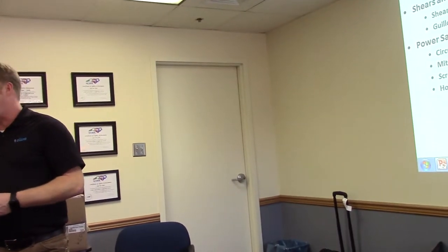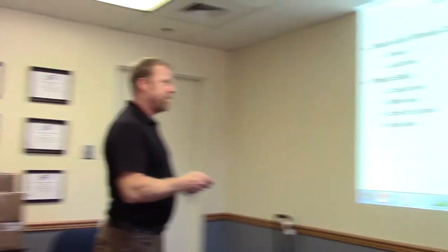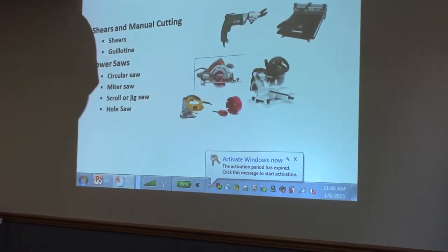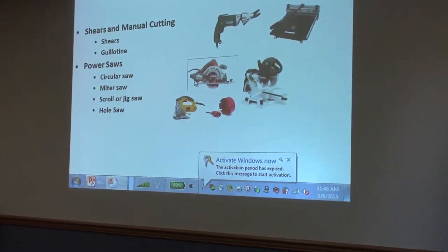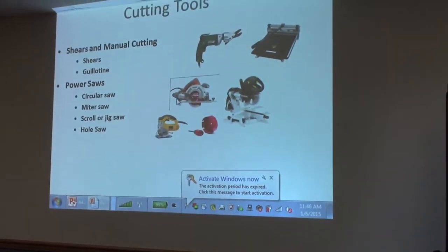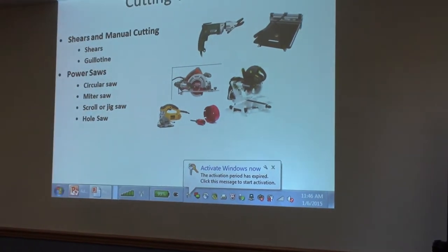If you're a professional contractor, you can't stack cut — if you try, they don't work very long. The hole saw is a carbide tip. If you use a bi-metal blade, it goes south pretty quick. You do need a carbide tip or diamond tip blade for cutting in your light blocks or hose bibs.